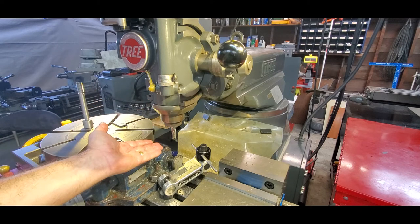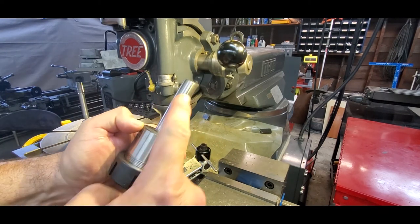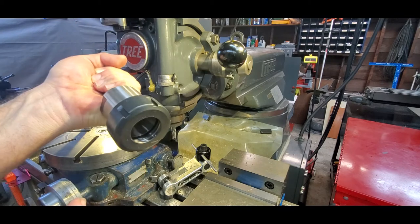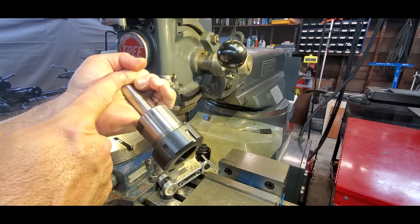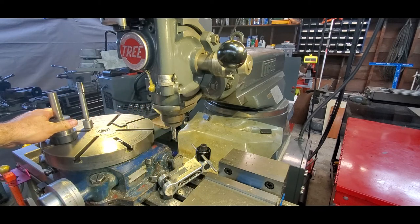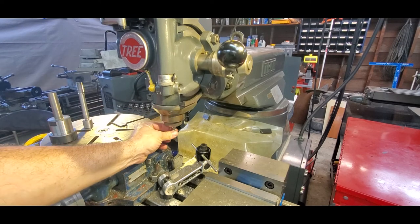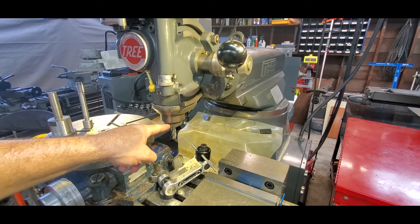It's an excellent system — it's all built in. I could use an ER collet chuck but I'd have to use a three-quarter inch collet and then use a collet there, so between my spindle I have one collet, two collets — more chance for error. Sure, it may be minimal, but this collet system is built in and therefore very accurate. No drawbar in the Tree — no drawbar to mess with. This is a Universal Engineering double taper collet closer.